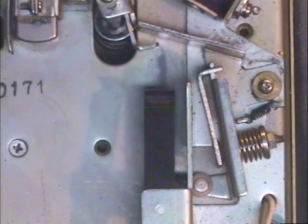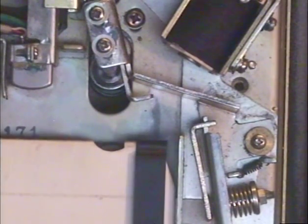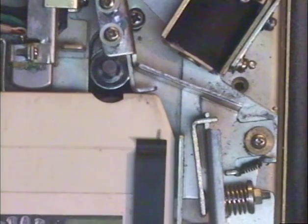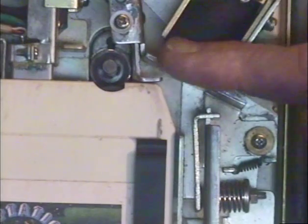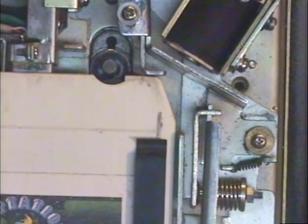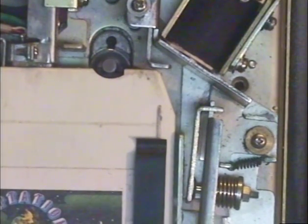It's pretty similar to the mechanism used in a 1970 Chrysler Radio 8-Track player. The way that it works is: as you start to push your tape in, you run up against this little pawl right there. You can see the tape is touching that pawl, and as you keep pushing the tape in, that pawl goes back to where this metal plate gets close to a solenoid. At the same time, the 8-Track tape is also engaging a power switch which energizes that solenoid. We push the tape a little farther and boom — the solenoid grabs onto that metal and holds that tape in place.